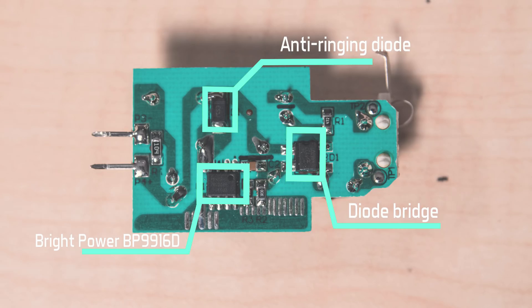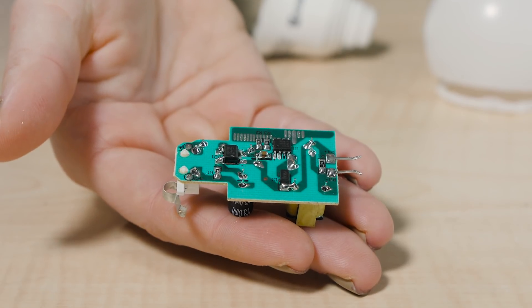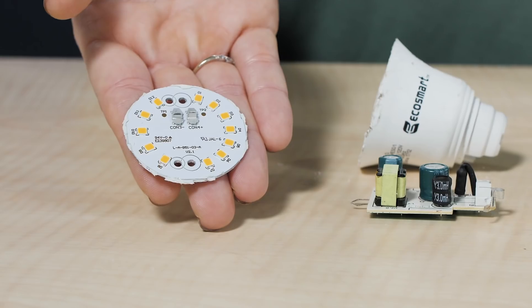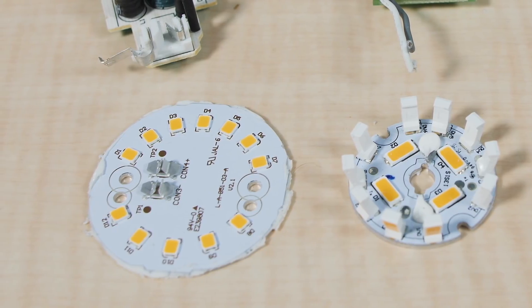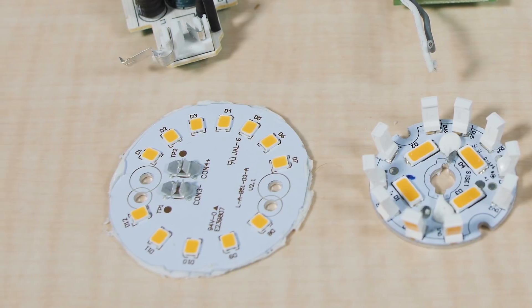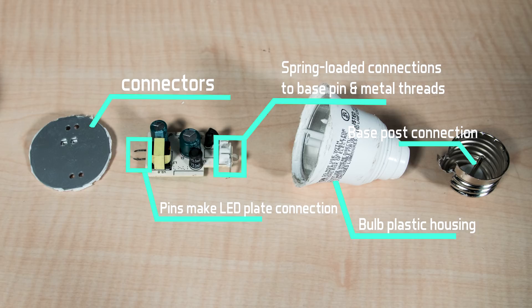There are an additional three resistors that seem to be there as part of a test circuit. The main resistor is a sense resistor used to convert the buck converter from a voltage output to a current output device. The discrete diode seems to be there to damp off any ringing from the switched inductor-capacitor network. The only heat sink is the metal LED plate itself. The PCB fits in the plastic housing via plastic slots, and there's a metalized area on the inside of the housing, though it doesn't touch the PCB — it's probably there for EMI shielding.